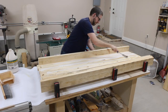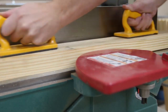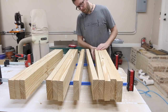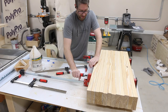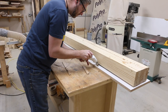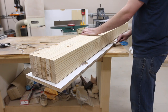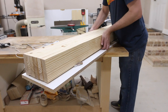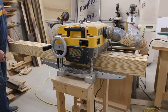I ended up doing the top in three sections so it would still fit through my planer. I don't have a jointer wide enough to use for those pieces, so I made a sled out of some melamine and shimmed the section where it would not move and secured it with hot glue. Then I could pass it through the planer a few times to create one flat face. This was pretty difficult because they weighed so much — each of these panels was over 50 pounds. I had to catch them and lift them as they came out of the planer so it would not snipe into the cutter head.